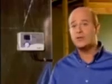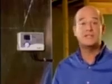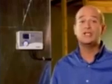If you want more humidity, turn the dial up 1 increment. If you have condensation on your windows, then you want to turn the dial down 1 increment. During the coldest part of this first winter, you may need to make some minor adjustments to the setting. Once this is done, you shouldn't need to make any further adjustments.